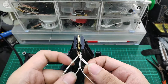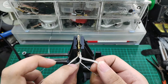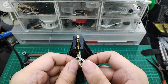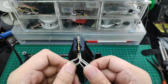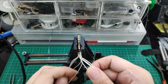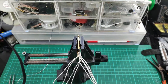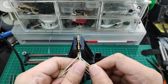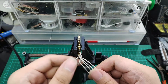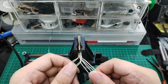Once you cross this, remember, these 2 wires have to be set back to their original position — so it's still 1, 2, 3 and 4. Sometimes they will cross over and become 1, 2, 4, 3, so do take note and pull them back. This is your new cable 1 for the right set, and this is the same cable 1 from the left side. The old cable 1 will become cable 4 currently.